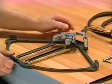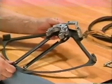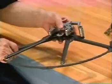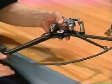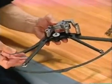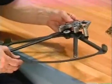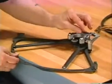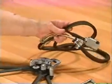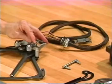We are looking at some of the components here that make up the table assembly and the pin spotter. This is one of the respot cells, of which there are 10. They can be rebuilt, each part replaced separately. The two fingers, the one to the front and the one to the rear, are identical. These are new style fingers with simply a small pad on the bottom. The wiring from the respot cell goes up into the front of the machine through this cable. This information is necessary in order to indicate when a pin has been picked up by that particular respot cell.